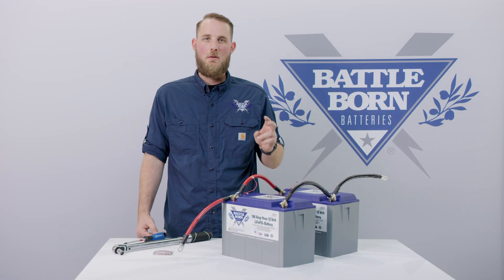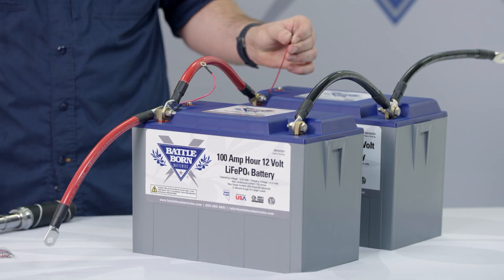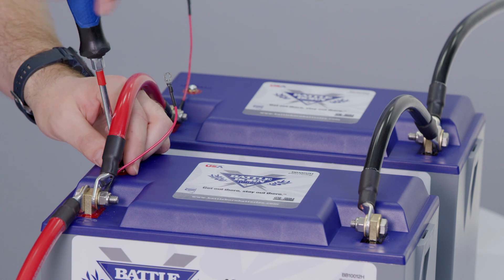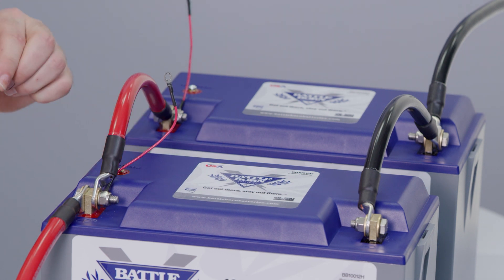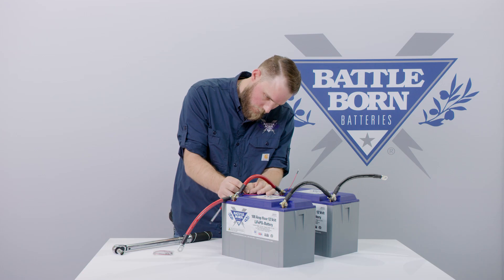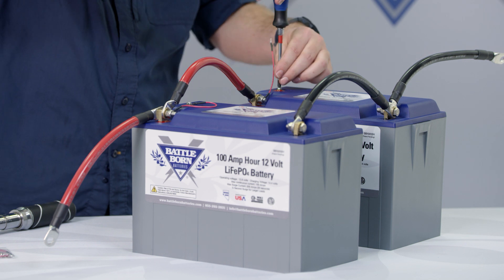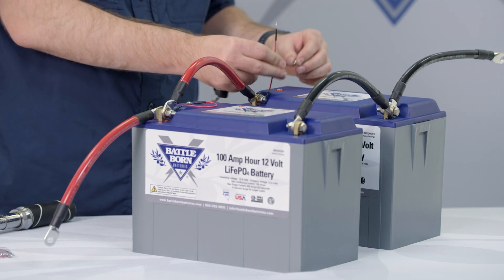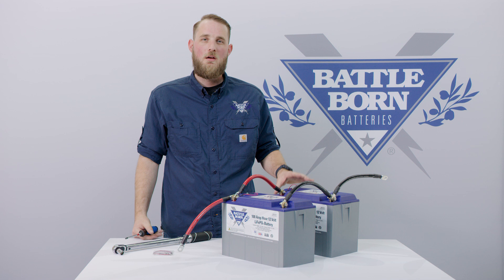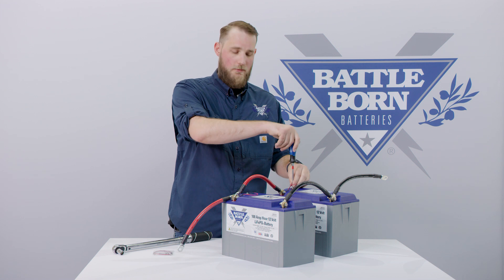Let's go over how to enable multiple heated batteries in a parallel connection. One way is to have an individual jumper on each battery connection. Simply unscrew, place your heater-enabled jumper down onto your enable post, and connect your second jumper. With both jumpers connected, both batteries' heater functions are now enabled. To disable, simply remove the connections.